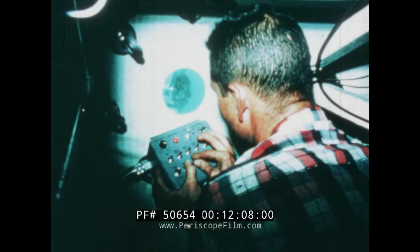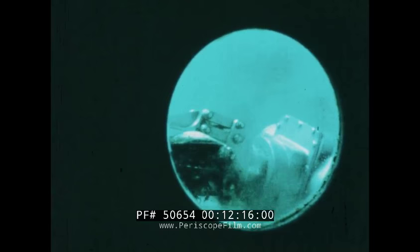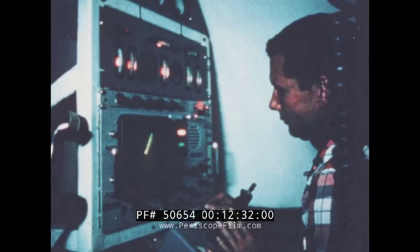The small control box held by the operator lets him look at his selected specimens from every angle. A sonar system extends underwater visibility and gives visual indication of objects ahead to the operator. A camera drive system permits the operator to move the cameras in every direction to perform scientific photography, including a television monitor for direct underwater images.